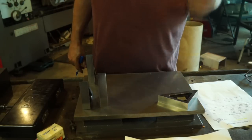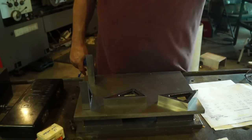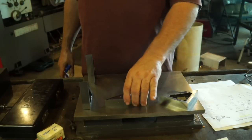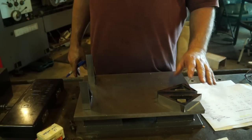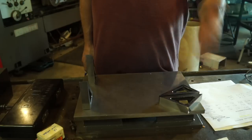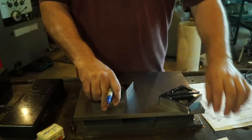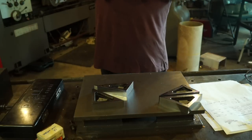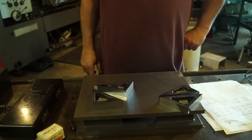Two and a half tenths over five inches is pretty good — I think that's about class A, grade A for angle plates. B1 is within a half-thousandth on all corners: one corner was seven-tenths, one was two-tenths, one was five-tenths. So I have a set here that I would consider okay for precision work, and I've pretty much hit my goal. That's pretty good on a 50-year-old grinder and one of the first times I've ever tried to grind things like this. These two I may come back and work on, but in the overall scheme of things they're accurate enough for most work — not for measuring, but for layout and setup they're plenty good enough.